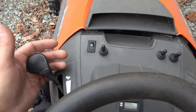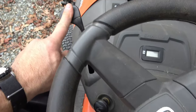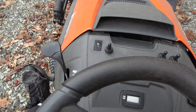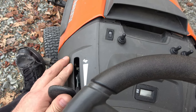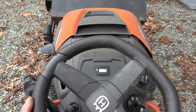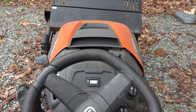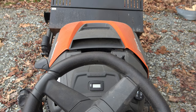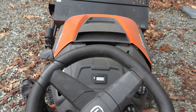First, I just want to show you the controls up here. We have our speed control. This one has a separate choke — a lot of the older ones, you pushed it up far enough and it would go to choke, but this one is just slow and run. For doing gardening work, pulling a tiller or whatnot, I usually run it towards the bottom and barely creep along. One disadvantage of a hydrostatic transmission in a garden tractor is that it can be difficult to go slow enough and get enough power when using the tiller or cultivator. Throttling back seems to help with that a lot.